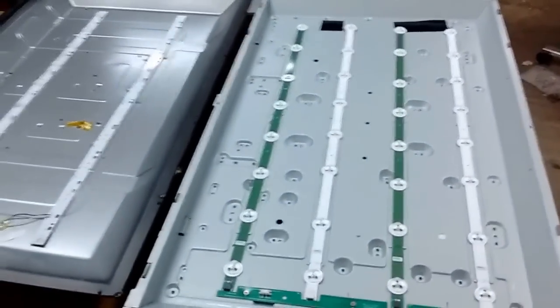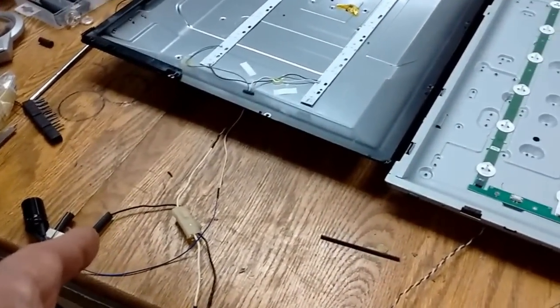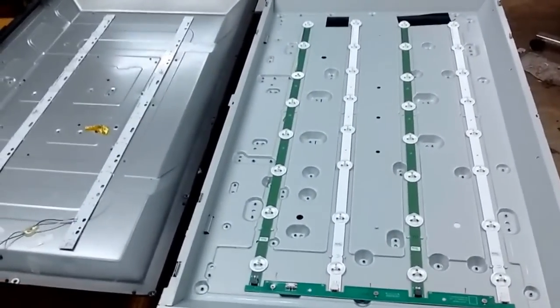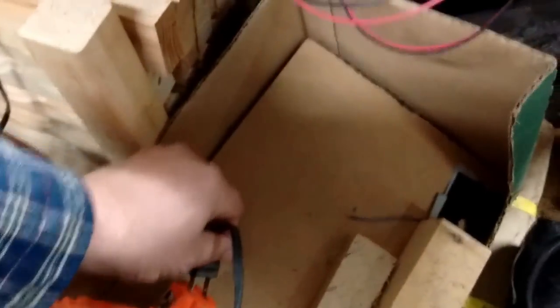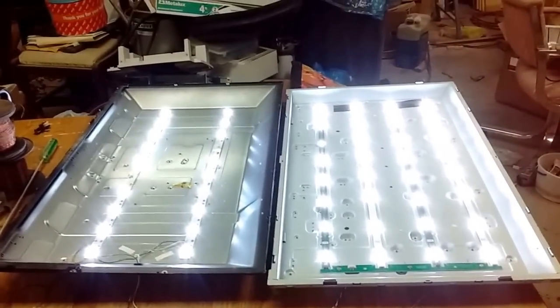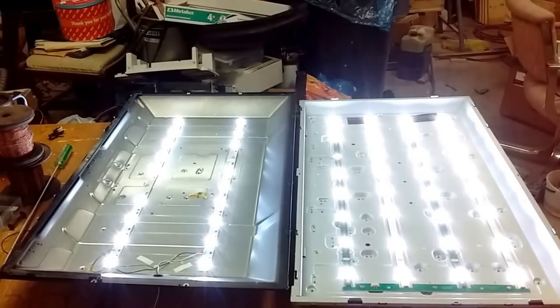And that's it. The biggest trick is making sure you've got enough diodes to handle the voltage. You've got 196 volts DC at the bridge rectifier, and the diodes take about 4 volts each, so you divide that up and it gives you roughly 50 diodes. If you get anywhere in that ballpark you should be fine. You can control how bright or dim it is just by the ohmage of the resistor — this one is a 33 ohm 10 watt resistor and that seems to work really well. Let me go ahead and plug it in so you can see it here on the bench. You can see that it works — nice and bright, provides lots of lighting. I made this all out of junk, it cost me nothing, maybe a little bit of money in the heat shrink. Super cheap and very efficient, very bright.